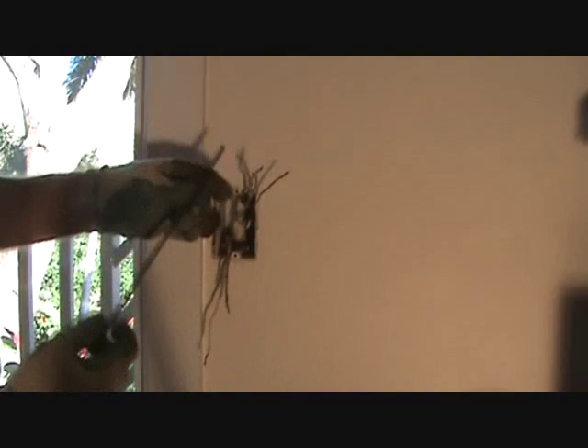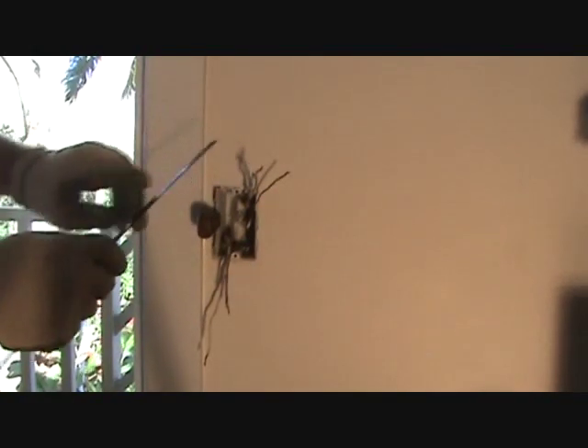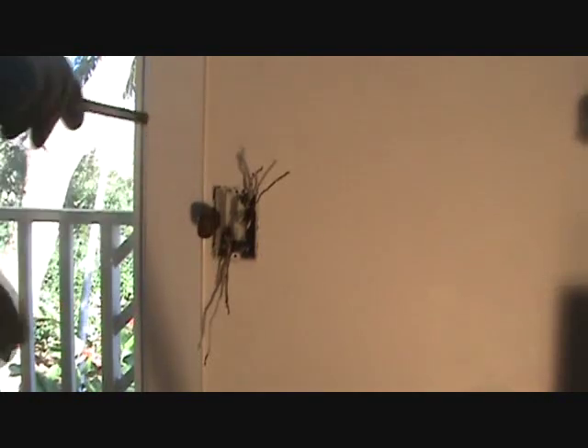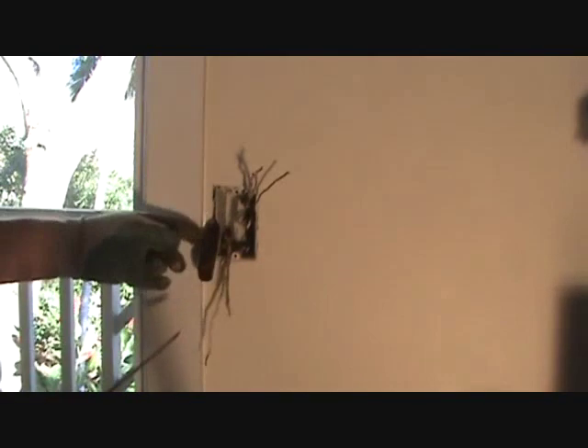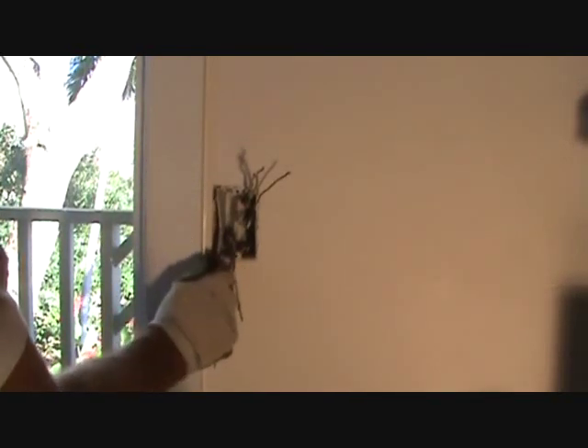Put on some gloves and I've got just a hacksaw blade — that's all. I'm going to hang onto this and use it as a little saw. Make sure the blade on the hacksaw is facing forward so you're cutting. I've got the putty knife in here just to keep the pressure off the side so I can do this. Now if that doesn't give you enough room, you can poke a little screwdriver in there — that gives you even more room.